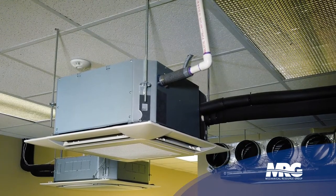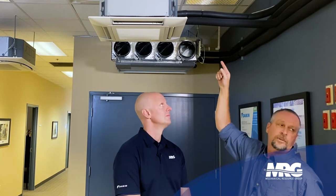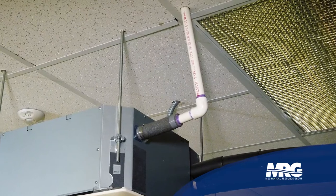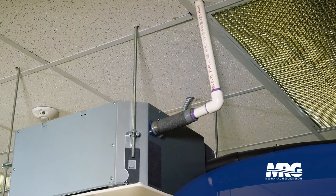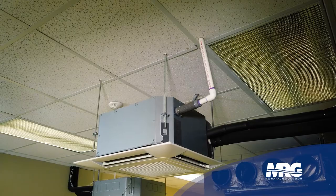It has to be a three-quarter inch PVC drain line for these field installed pumps. They do not have enough lift in the pump to pump through anything larger than three-quarters. So it's super critical to put the drain on properly with the gray flexible hose, and then run your three-quarter inch PVC after that. You want to maintain just a little over 12 inches of horizontal pipe coming out before you turn up. After you turn the pipe up, there's only so much height that pump has lift for — this particular unit can do about a 21 inch vertical rise before you need to start going with a gravity drain.